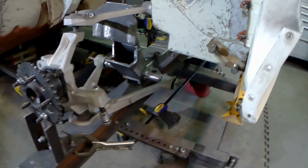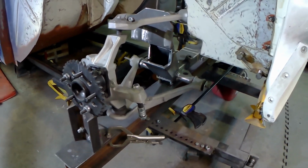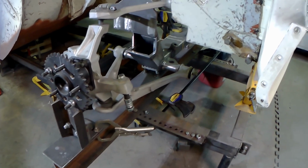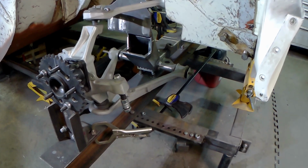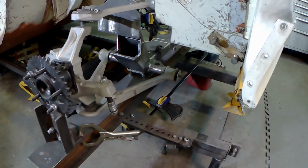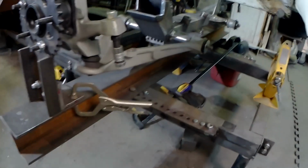I bought it because the Corvette C4 suspension geometry and the forged aluminum parts and all the rest of it are rather better than anything else that's out there in the market at this time. There are a number of issues with this crossmember, and there are things about it that I really don't like. The first was that the bottom of it wasn't flat or level. It's made out of a piece of 4-inch tube. There's really no reason that it shouldn't be so, other than when it was welded and then ground, it was hard to pick up a reference point for it.